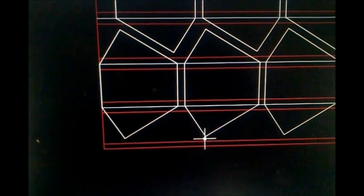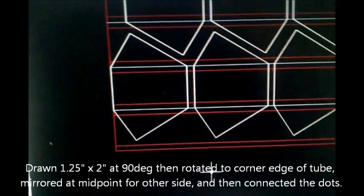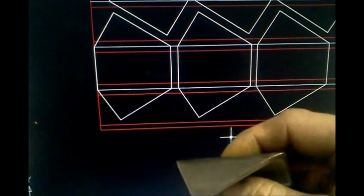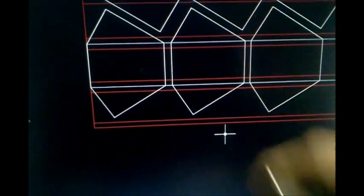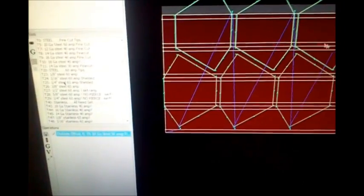I drew this leg, and connected the two, and I drew it flat, and then rotated it up here, and then drew my lines connecting, and that gives us a plenty respectable gusset. I mean, with no ortho correction for the sides or anything, or 3D CAD or anything. So there, that part's done. Oops, wrong Sheetcam. Now we got Sheetcam, and here's what we're laying out. We're cutting out 6 of them and then cutting off the tube.